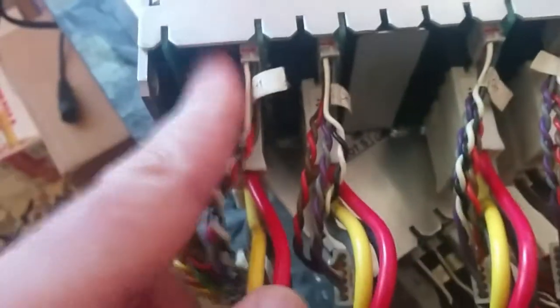This board contains two parts inside. The first part is a high voltage part — when the main AC current comes in, 220 or 120 volts AC, it turns into 375 volts DC. Then it turns that into high current 24 volts DC. We have vertical boards here — one, two, three, four. This is the second board. We have three vertical boards, and each of these boards are DC-to-DC converters, turning the high voltage 375 volts into high current 24 volts DC.